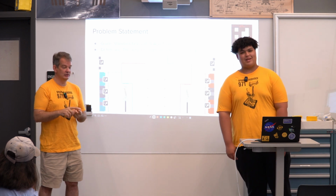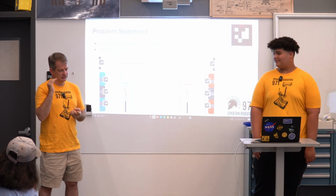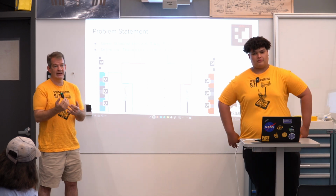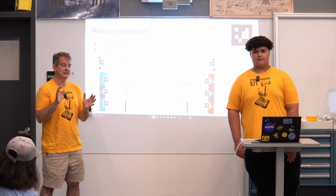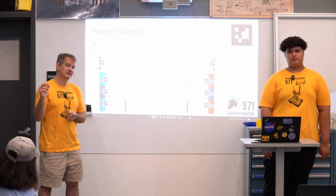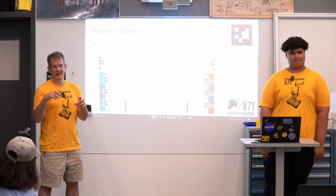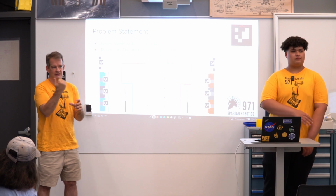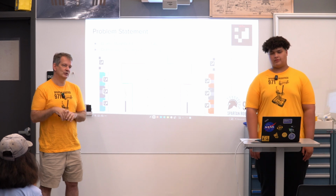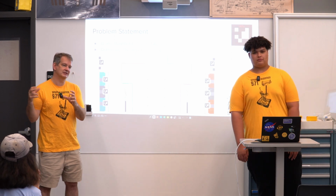There hasn't been a lot. We're using a rolling shutter, so you're going to have some latency and delay in the data you get out. It also has rolling shutter artifacts. What we do, primarily to get the data through fast, is use flat buffers, so there's not a lot of copying of images and it goes right into memory. We're keeping that data structure intact. So it's mostly just about processing fast.